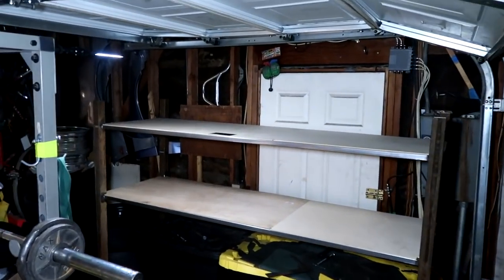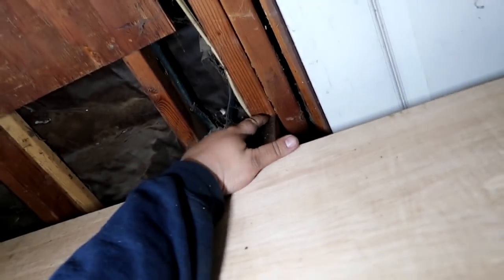Oh yeah. All right. I'm surprised how sturdy this is. I even added a little peg in the back right here to stop this from moving out of place. I had these bars in the middle spaced at 29 inches from the ends, because this is 2x4, right? So 4 feet ends here, and I needed a little edge for the lip to lay over on. So I did 29 inches, and you can see they're both sitting right in the middle of that.